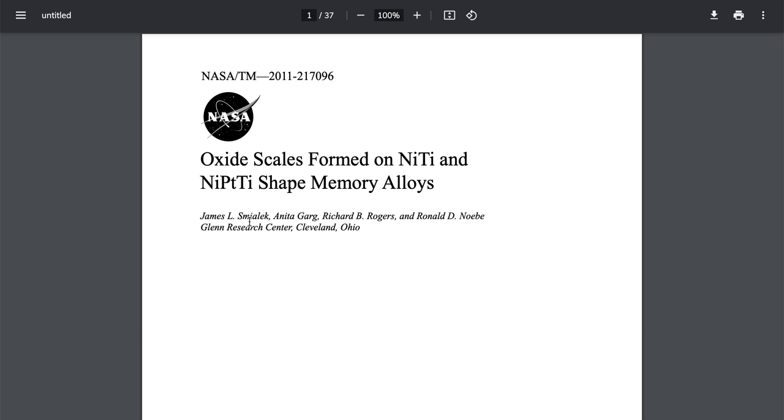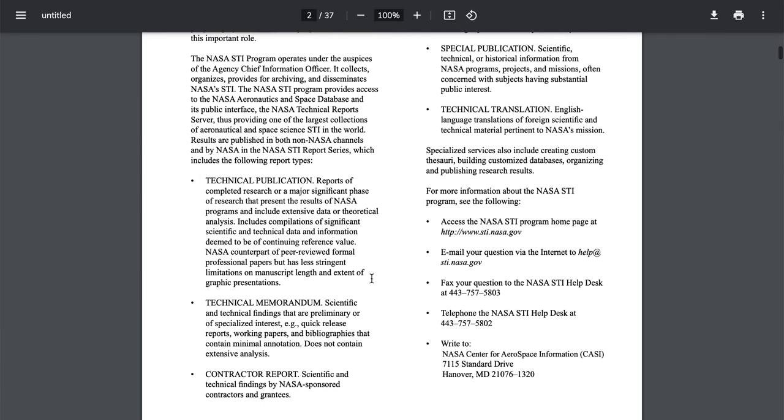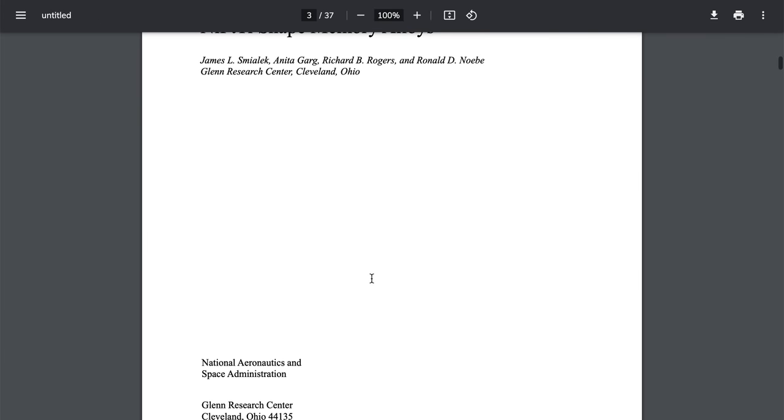The scale is up here, gold being one of the purest, and down here being aluminum. The further you're apart from each other in that scale, even in different metals, the more reaction will happen. The closer they are, the slower the reaction is. It's still happening, but slower.